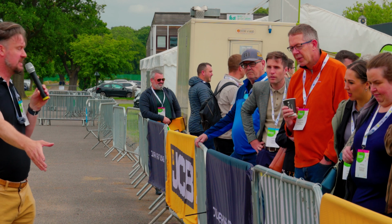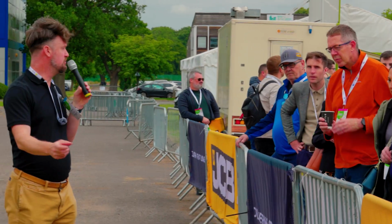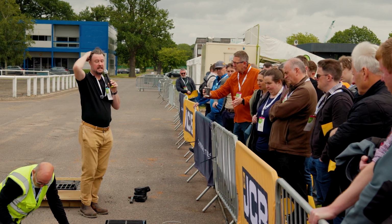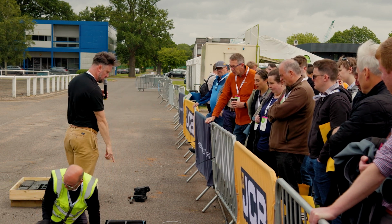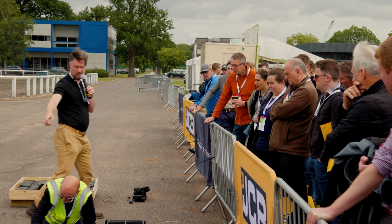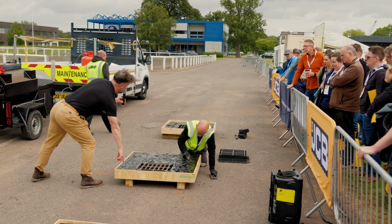Typically with an asphalt carriageway, you're bonding two bituminous products. And do you specify an extension round the edge? Yes, we do. So it's basically 50 mil. So apologies, it's 50 mil beyond 150 mil beyond the flange. So on the surface, you'd be looking at minimum 200 mil from the edge of there.